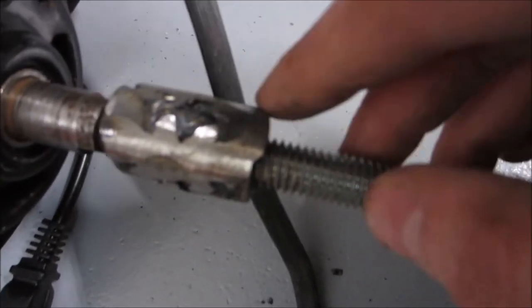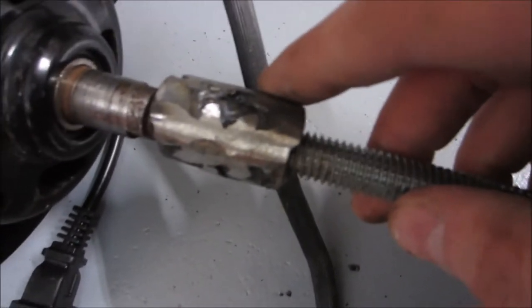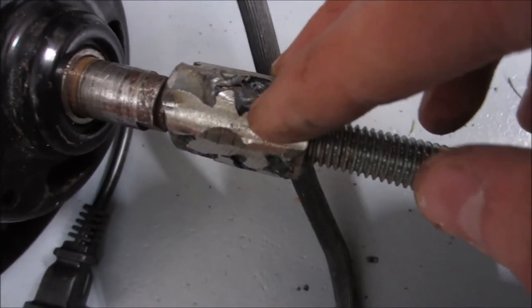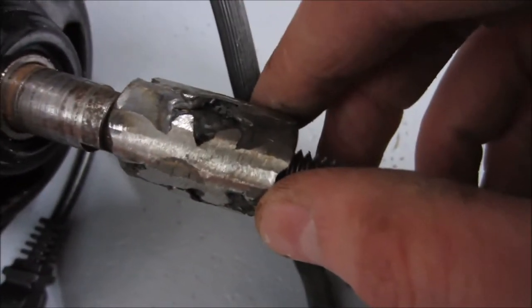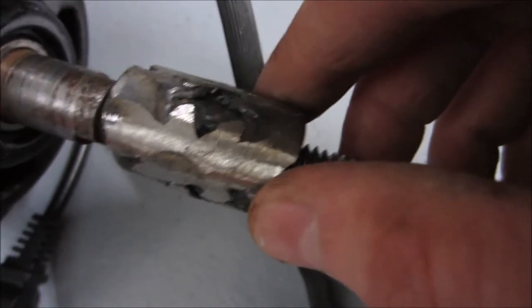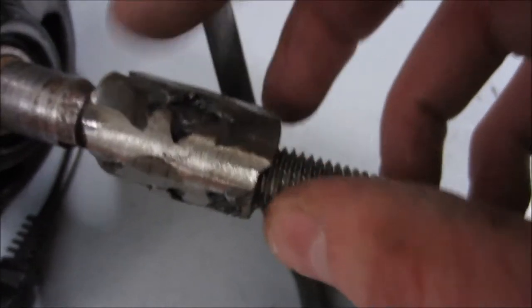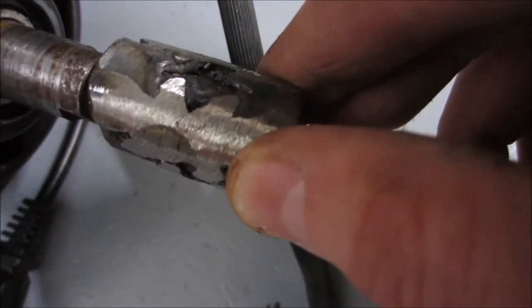I did this with a stick welder, so there was a lot of slag and that sort of thing. Messy, as expected, but I felt the penetration would be good. Obviously, it's not very strong. So what I'll end up doing is I'm going to drill through here and put a couple cross bars in to help lock the shafts in place, which also may act as shear pins in the instance where it seems to over torque. But the entire thing I don't think is going to be very strong. So this is really just kind of a prototype for testing.